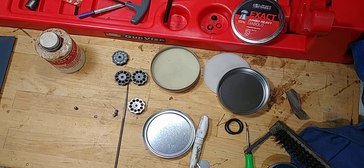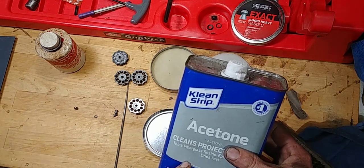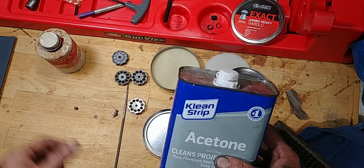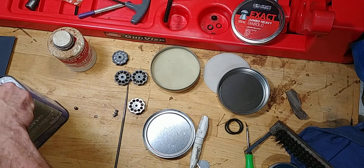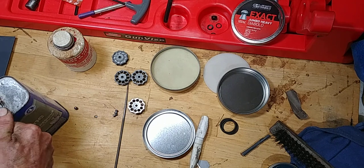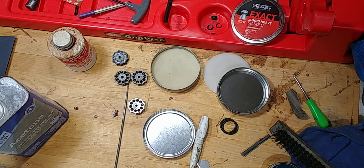I just need to find my acetone. You could use denatured alcohol, but alcohol on aluminum is never good. That's why I'm going to be coating them with the Dykem. It pays to have worked at a machine shop - you get used to using that. Anytime you use acetone, I always suggest rubber gloves. You do not actually want this absorbing into your skin - that's pretty much a no-no.